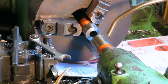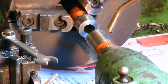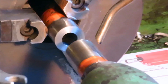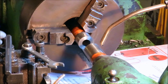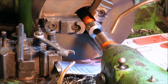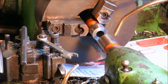So what we have here is this pipe — I don't know the wall thickness, just whatever. There's a Morse taper machined onto this piece, so you just put it into the Morse taper and we're going to be doing some friction welding. We're going to force them together and see what happens — hopefully they'll weld. We have some cardboard here to keep any sparks off the ways.